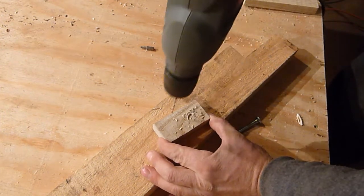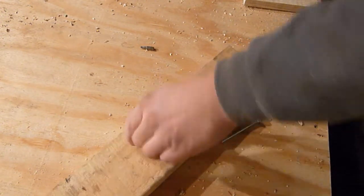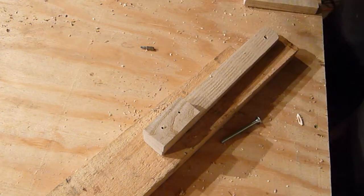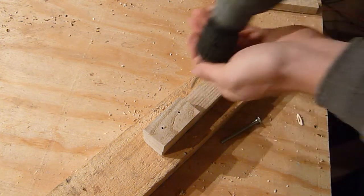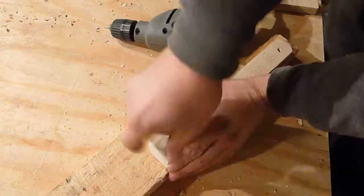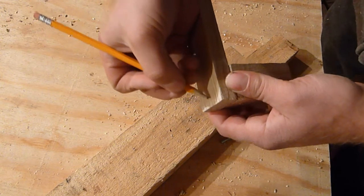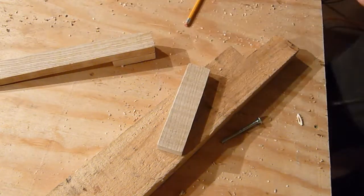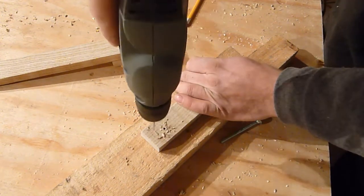Now we're going to assemble the end section of the camera arm. Using a 1/8-inch drill, drill two holes in the 3-inch 1x2 and place it at the square end of the last 12-inch 1x2 that only has one rounded end and screw it to it. Now with the 6-inch 1x2, place it at the end and use a pencil to mark where the other two 1x2s line up. This is so we can drill pilot holes.